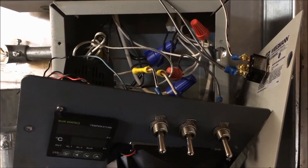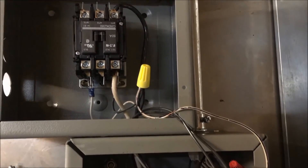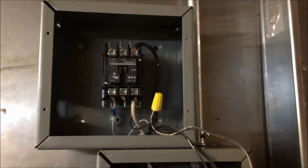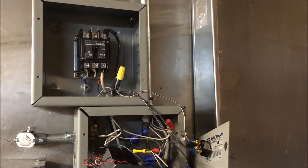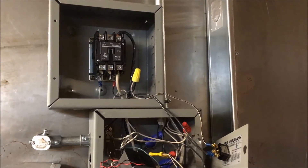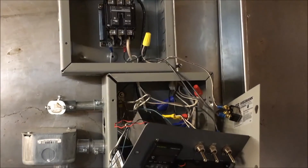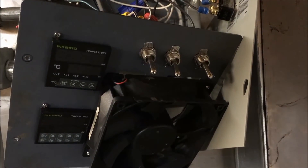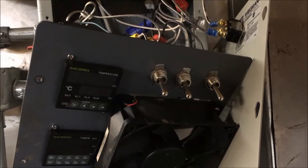I have it set up so it can either get positive 120 through this switch directly off the main 120 bus coming into the bottom box, or through the solid state relay that's being controlled by the temperature controller. So basically it's a preheat switch — it bypasses the solid state relay during preheat. I'm hoping that only putting a couple of amps of 120 through those solid state relays, and only using it intermittently rather than getting current through it for 45 minutes during preheat, will greatly improve the reliability of that so far completely unusable part. I had to keep it in the system because this temperature controller only sends out 12 volt DC control voltage, and that's not enough to close this big fat relay.